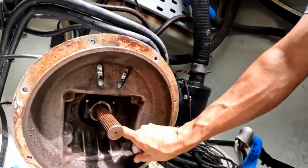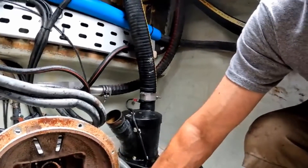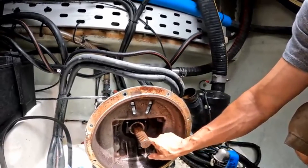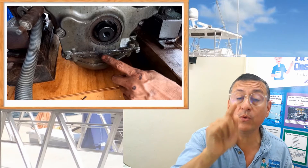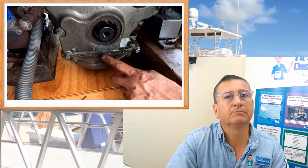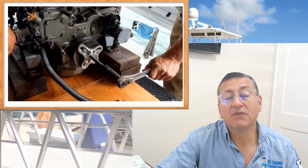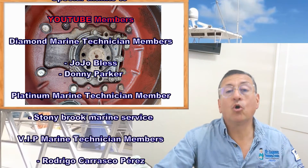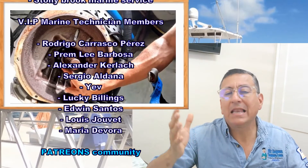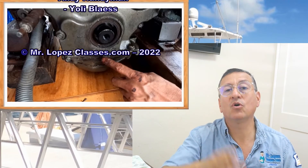You can see the seal is in perfect condition — completely dry. This is not a problem; it is not leaking. There is some water because it was raining while we were removing the engine, but the seal itself is in great condition — one less problem. We are going to replace the other seals. The difficult part is always getting access to those seals. Always, always use original seals — no aftermarket — use original seals, and use the proper puller to remove the harmonic balancer. Those are the possibilities for oil leaks in inboard engines: the front crankshaft seal, the back crankshaft seal, or the main shaft seal of the transmission. There is only a small possibility it is the valve cover seal or the oil pan seal. In general, it is those crankshaft seals. Good luck.